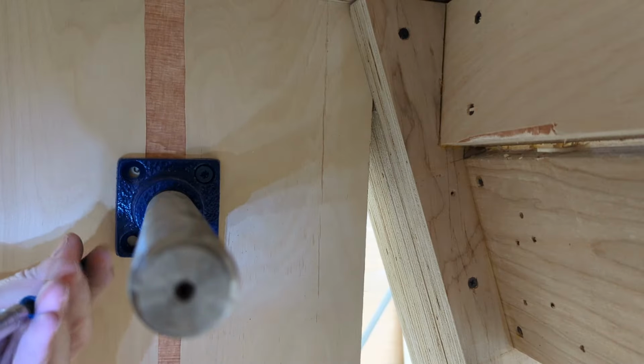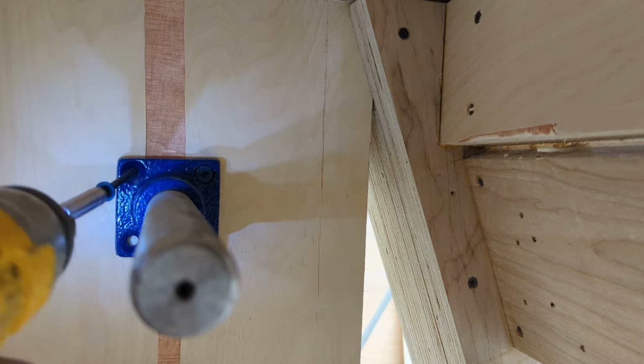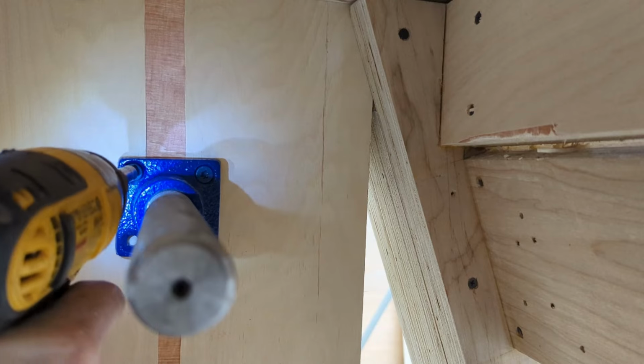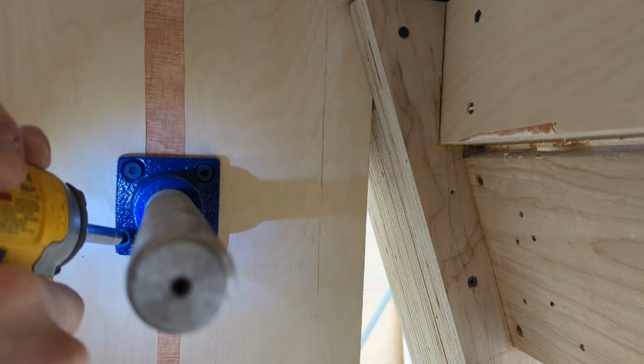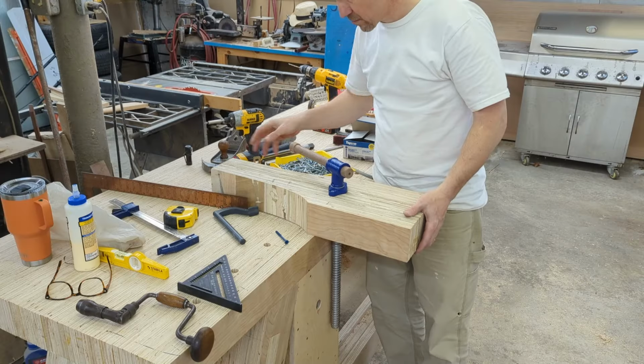Attaching the vise nut on the back side of the base is as simple as running in a set of 1/4 inch by 3 1/4 inch Tapcon flathead screws. They will work great. I did end up having to shim that right side a bit. It seems that the nut itself is just off perpendicular from the casting.